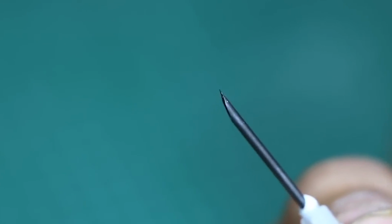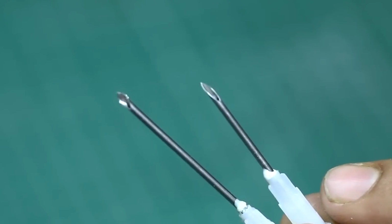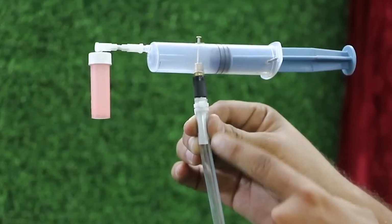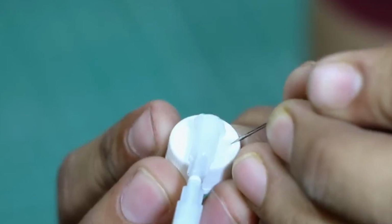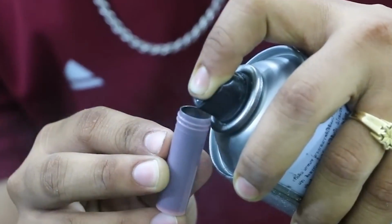The tail of the DIY sprayer is expanded into a cone to securely hold the needle in place without wobbling. A piece of wire is attached to the front end for easy centering of the needle in the nose of the plunger. After soldering the body, the protruding part of the needle is processed to be perfectly straight, after which the wire can be pulled out through a ring-shaped slot. Finally, fill a syringe with paint and you're ready to paint all the necessary parts.